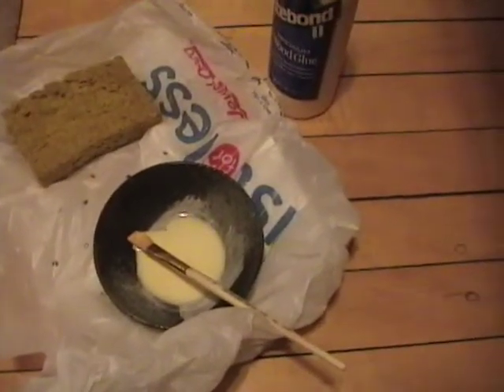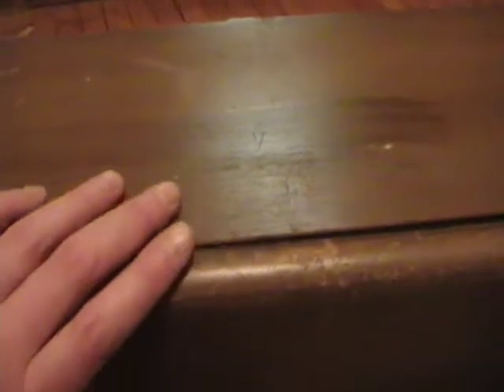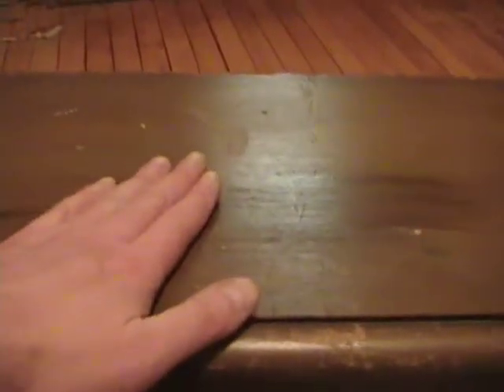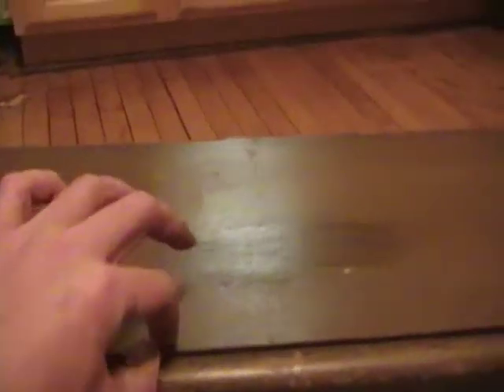Here's my technique to re-glue veneer. I've got a little bowl with some Titebond II diluted with water. I first start with a fairly dilute solution — like two parts water, one part glue — and take a brush and just flood it in. Then tilt the whole thing on its side so gravity pulls the water and glue down inside. It forms a kind of pumping action to get it in as far as the opening will go. Then make a thicker mix — one part glue, one part water — flood that in, and finally use straight glue along the edge closest to the split.